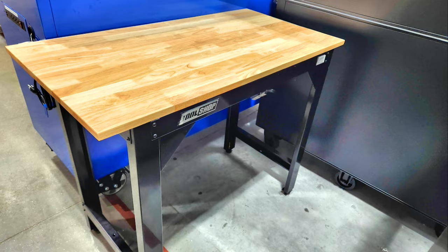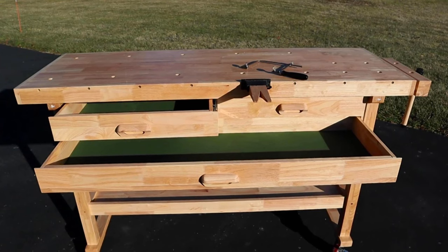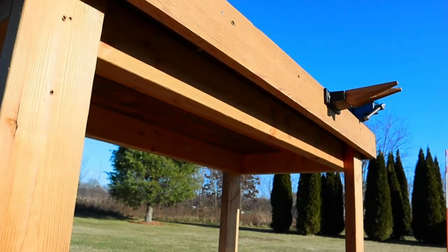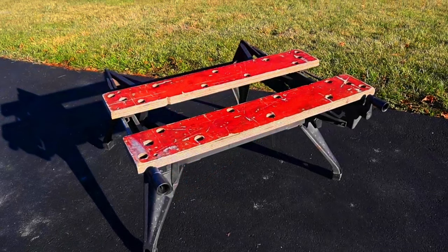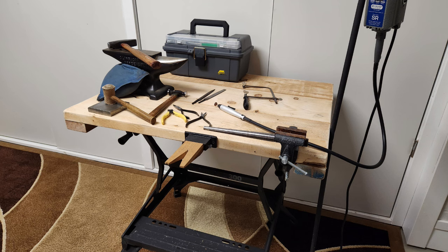Pre-made universal workbenches with metal legs and wooden tops can be moderately inexpensive and are solidly built. This wooden workbench has convenient built-in drawers, and the hardwood top will take a beating if needed. Thrift stores have bargain-priced desks that can be retrofitted into inexpensive benches. Using scrap wood and a few screws, you can build a bench that is either a standalone or a built-in bench that fits your studio space perfectly. A portable or temporary option is a foldable workbench base — by adding a snug-fit wooden top, you'll have a bench that can be stored anywhere when not in use. I use this bench for off-site demonstrations, and it is even sturdy enough to hold an anvil.